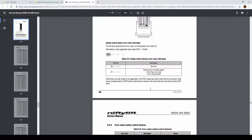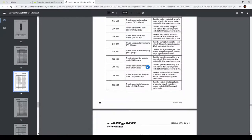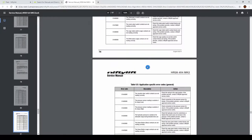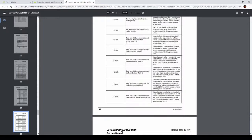Alright, so the error codes I did have - zero-one-C4, let me look for this. Zero-one general error... zero-one-A, zero-one-B, zero-one-C - here we go. Error code 01C4: there is no CAN bus communication with the motor controller.